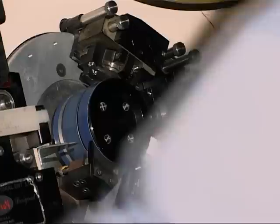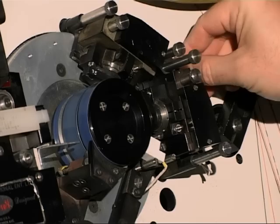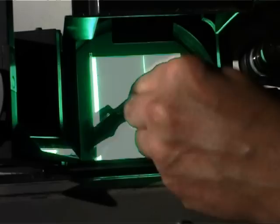While we're here, we can also check that the combined magnetic sound head is clean. If there are any stubborn deposits of oxide on there, a little isopropyl alcohol on the cotton bud will help. Finally, let's check that the cathode ray tube and the mirror are clean from any dust and dirt. Use a camel hair brush — open the flap — and very gently on the mirror surface to avoid scratching it, dust off any loose particles, and on the tube face inside. Then close the hatch.